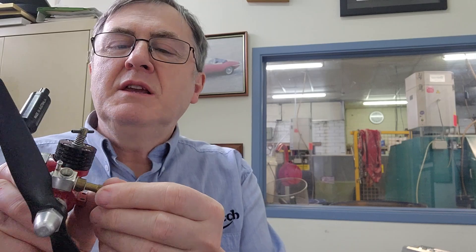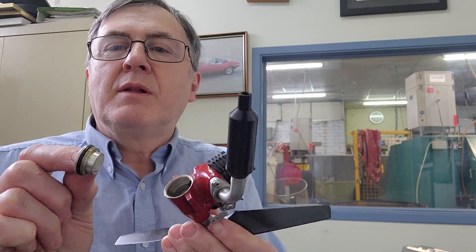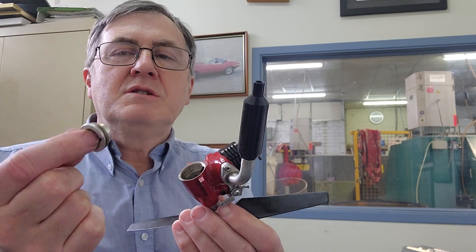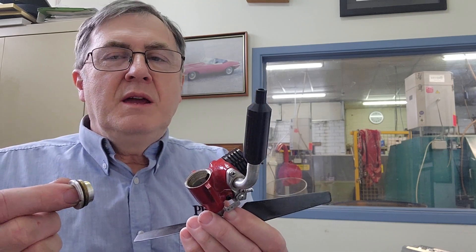The carburetor was mostly milled up on manual milling machines using jigs and fixtures — that's how we did it, so it's very block shaped as you can imagine. The screw-on sump plug was commonly used on some of the 1960s and 70s model engines. By the 80s and 90s they tended to go with a nice die cast and four little screws, but here again we didn't have that capacity so we went with the old style, and it's quite effective.